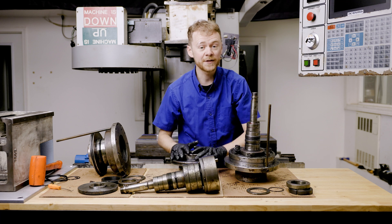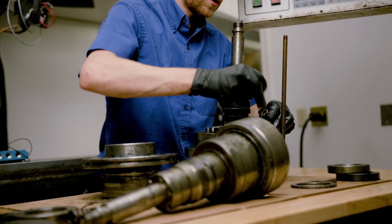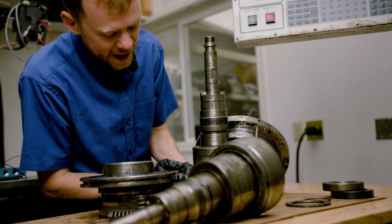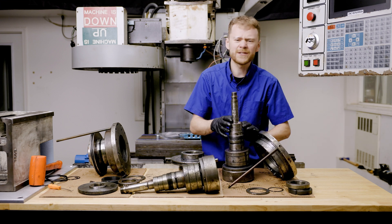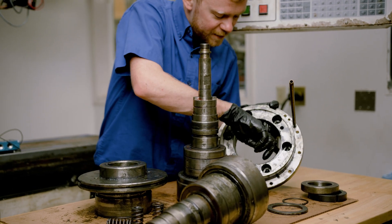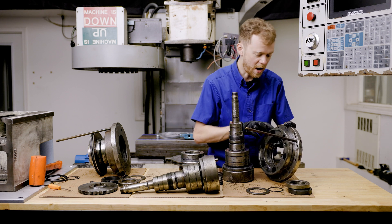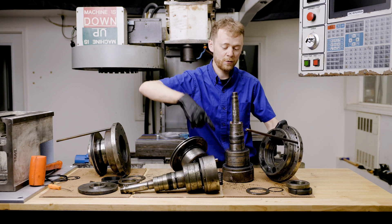When you're taking things apart, I'd say leave the o-rings on so you get everything clean, clean, clean. Then you can put the o-rings on and put grease on everything. Here are our springs — these are all in decent condition. Then this will come off. There's a spacer down here that won't come off unless you pull these. At this point, clean everything — acetone, any type of kerosene would be fine. Then we're gonna put a new quad ring inside here. These are groove rings; you want to grease everything down. Grease the bearings, but don't over-grease — we don't want it to hydro-lock and become hydraulic in here. An o-ring goes here, quad ring, quad ring, quad ring, o-ring, and then there's an o-ring that comes in the kit which seals the turret.